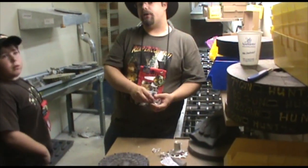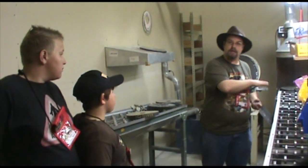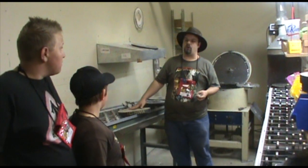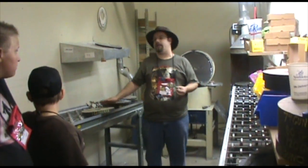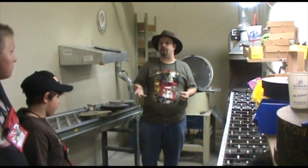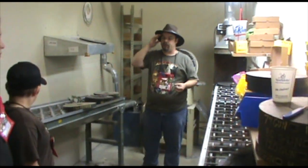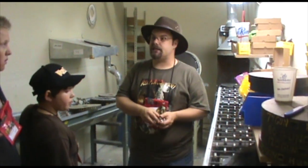Yeah. Or we generate a batch of between 10 and 20 molds. They'll line these molds up on these racks, and these racks help control the temperature. Heat is the number one enemy of the molds. Rubber does not want to be superheated and then cooled off and then heated and then cooled off. It happens to your tires, and you'll know your car tires get crumbly. Our molds will do the same thing. And when those oils are completely dried up inside, that rubber turns to dust and becomes useless, and we have to make new molds of it.